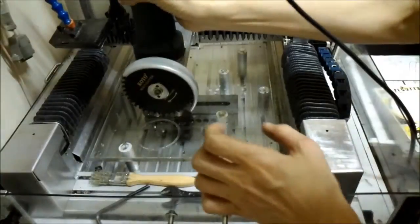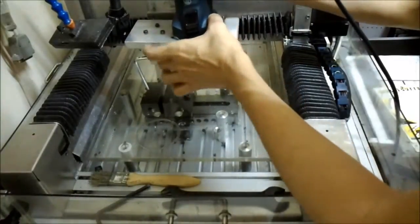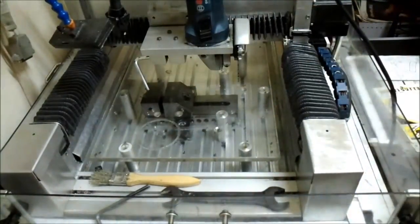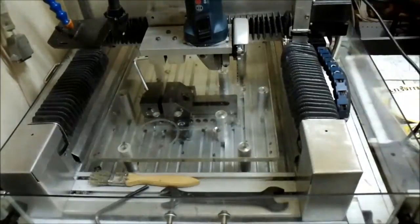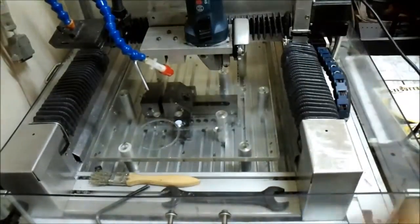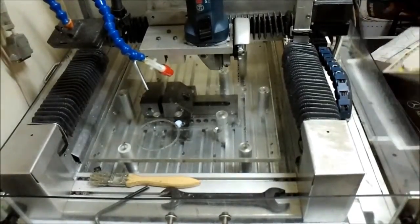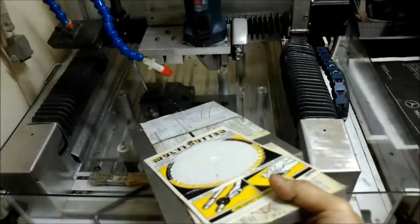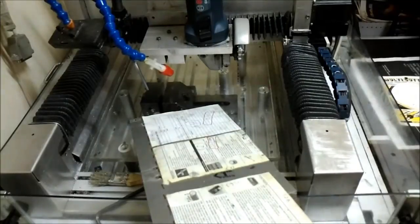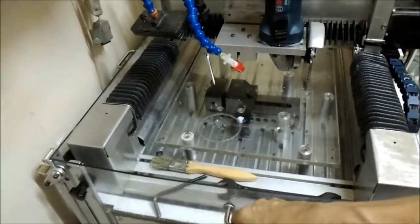In the next video I will show you cutting it in the next axis. My machine has adopted the flood coolant, and it's important for cutting aluminum — we need to have sufficient coolant.